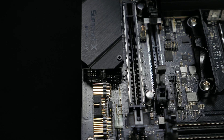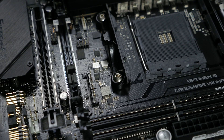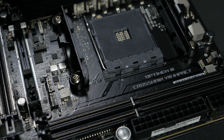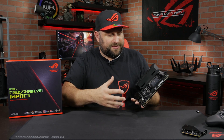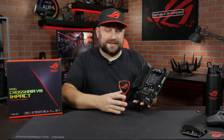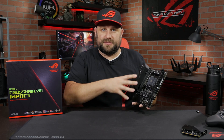The first thing I want to talk about is the design of this board. With small form-factor boards there are a ton of components we have to pack into a tight little space. A lot of companies will just worry about what components are in there, but we really worry about the topography — basically where everything is on the board and how it's laid out. We want to make sure it has an incredibly efficient power delivery from the power inputs to all of the components, which will generate less heat and give you an overall better and more reliable gaming experience.